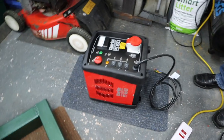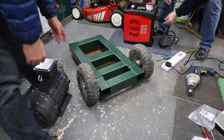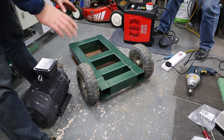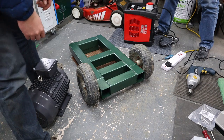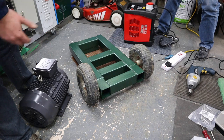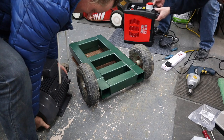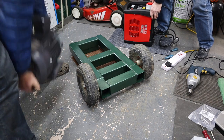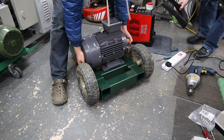This is a static phase converter - John's used these before. It's essentially got all the bits we need. We can use it just as the static converter, or combine it with the motor to make a rotary phase converter - a combination of the two. We're going to take the front cover off and get it mounted. I'll just leave the shaft sticking out for now - you can always chop it off or leave it just in case I need to add a starter to it. It'll be in a cupboard anyway.